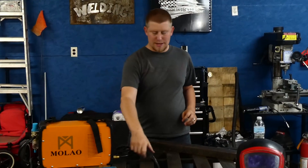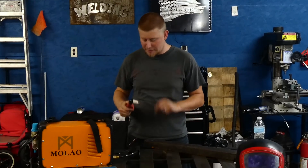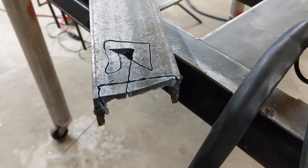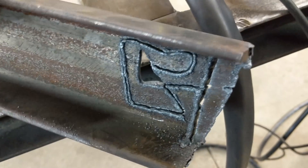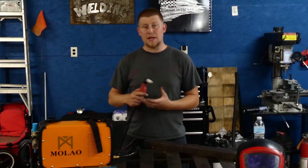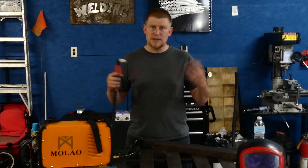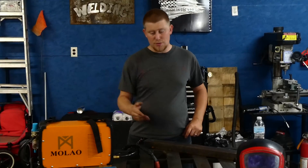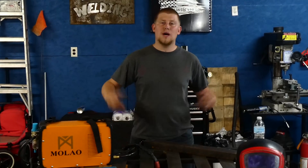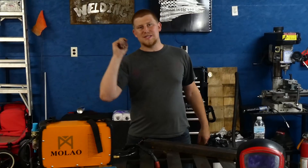This new torch is a lot easier to use. I like that I can actually feel the trigger pull when I'm using it, and maybe these tin-coated consumables might last a little longer. On this quarter inch it had no problem starting and cutting — I was pulling pretty quick. It cuts kind of nice and I prefer this new gun; it's a little bit nicer in the hand, closer to the Hypertherm's gun, but we still don't have the drag shield which I love on the Hypertherm. Let me know what you guys think about upgrading your cheap plasma cutter with a new torch. Let me know down in the comments below and what we can do better to make our videos more awesome. I'll see you in the next one.